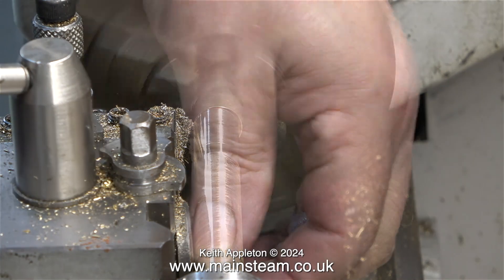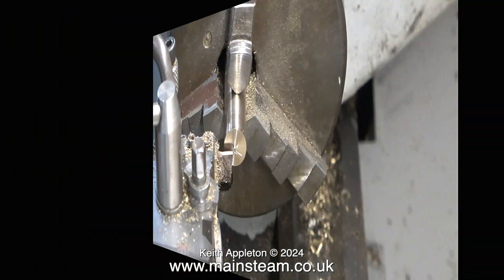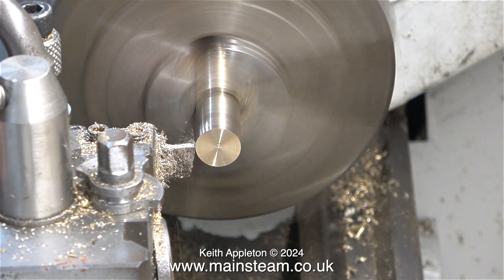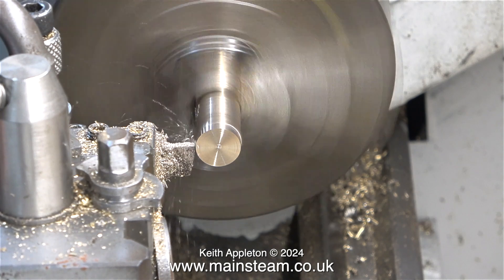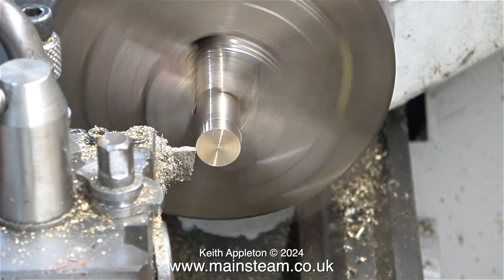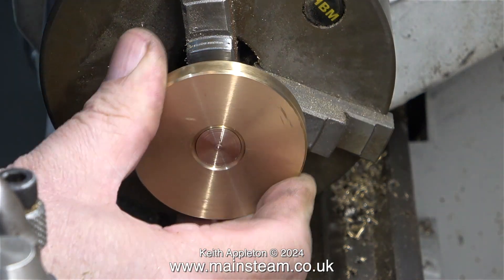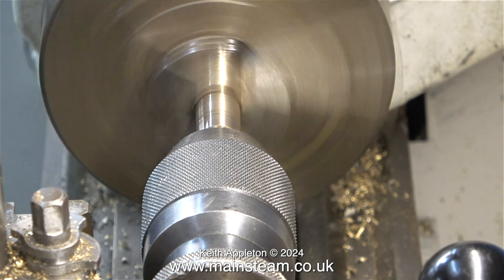Once I've finished the turning all the way down I parted it off. And here, still using the parting tool, I'm cleaning up the end. This short parting tool is quite a good turning tool — one of the better ones that I've got. It gives a very good finish and cuts very squarely. What I'm doing here is machining the end so it's a nice loose fit in the firebox plate. I also turn part of the plate a little bit oversize — this will allow silver solder to flow into it and make an even stronger joint.